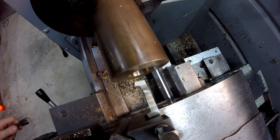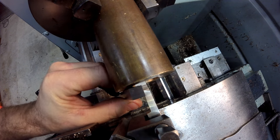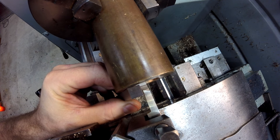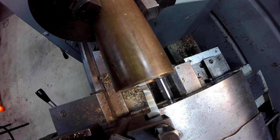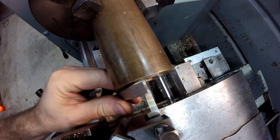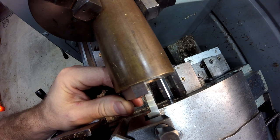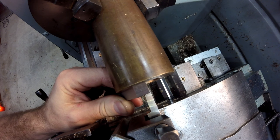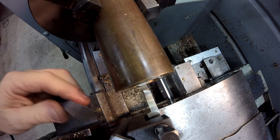So the way I do that, I just bring this in and I take another piece of ground tool or any bit of material you've got that's nice and straight, and I just close that up until I see the daylight on the edge of the job disappear. Now I'm going to set that at zero, then I'm going to come out and do that again and just see if I get the same reading twice. Within 0.15, so gives you some idea how good your feel is.